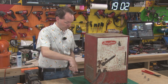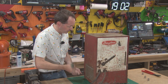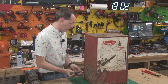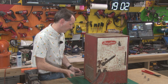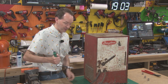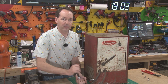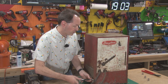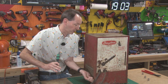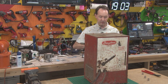So what we're going to do is make a device that will let us limit the current the transformer will suck through. You can limit voltage — voltage is really easy to mess with. You can do voltage limiting, which is basically just a light dimmer. The most robust, low-tech, bulletproof way to do voltage limiting and regulation is with a Variac.